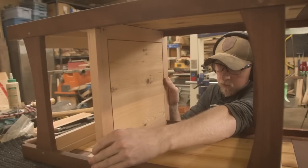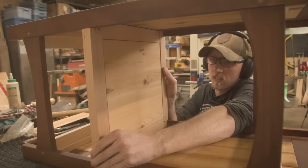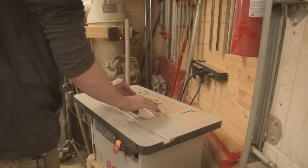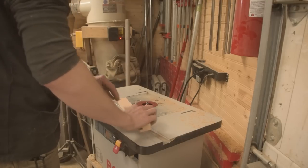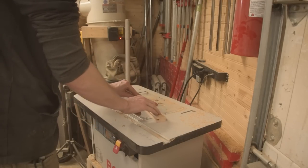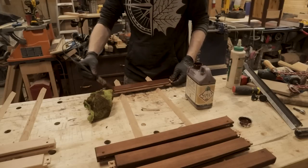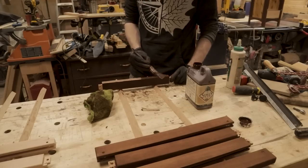I needed to slide the shelf in so that the front edge could go in and around that L-shaped leg. Then we go through and do all of our very important surface prep — putting bevels on all of our outside edges, stepping down the side pieces of the frame by about a sixteenth of an inch, sanding everything up to 220 grit, applying stain, applying oil, and then the very last step is the glue up.